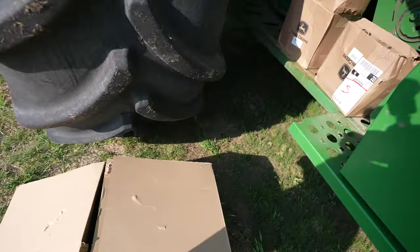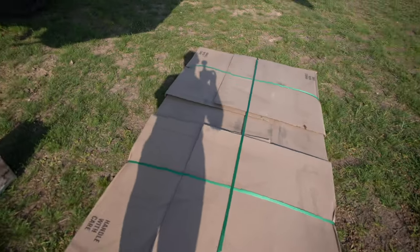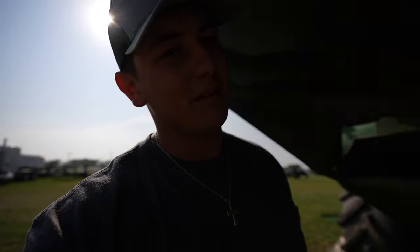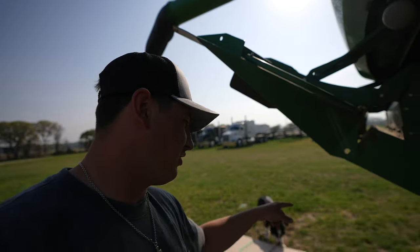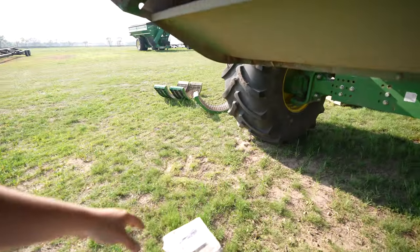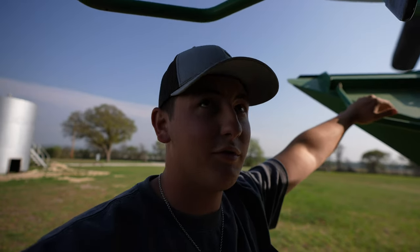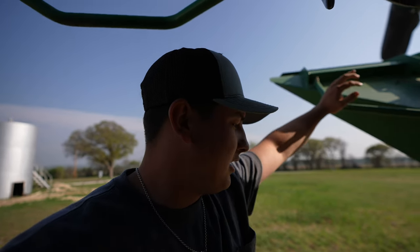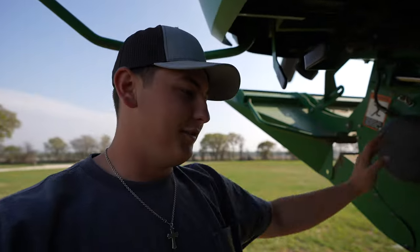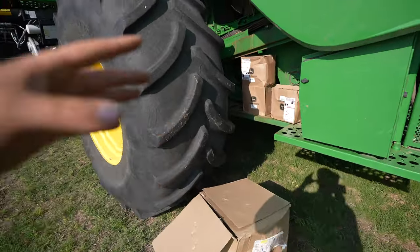We have all of Mom's rotor elements and tines right here, and we also have chopper knives and Mom's top sieve. I think me and Cody tomorrow morning are going to put on Mom's chopper knives — they're worn out on both sides so we have to put a new set on. We flipped the chopper knives over in Nebraska when we got rained out for like two or three weeks, and they've lasted since Nebraska — that tells you how good chopper knives are. Top sieve, rotor elements and tines will also go in next video.